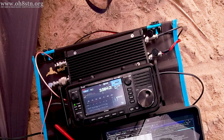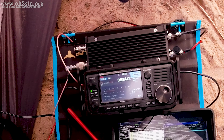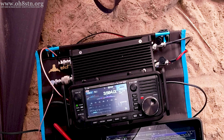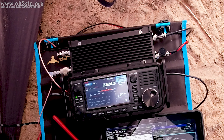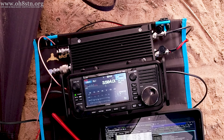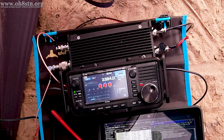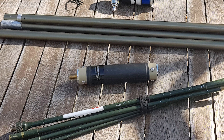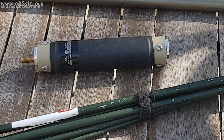This is probably unclear if you haven't watched my PA500 video yet, but this amplifier has a built-in antenna tuner. The tuner is completely automated and a perfect match for any broadband antenna, especially the Chameleon MPAS 2.0. I wanted to work 80 meters on this day — 80 and 60 meters actually would have been ideal. So I set up the counterpoise wires and the MPAS, but I made one modification: adding the Super Antenna MC80 coil between the MIL Extension 2.0 and the MIL Whip 2.0.